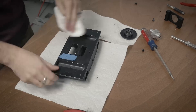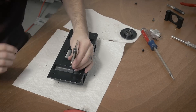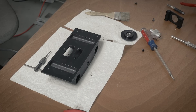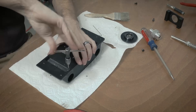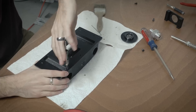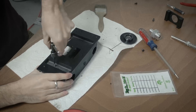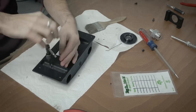The only thing left to do before I install the bearings into the bearing block is to tap these eight holes. One little note about tapping holes: do not do this at 9:30 at night when you're really tired and have been working on this project all day because you will break a tap like I did. I had completely forgotten how fragile a 4-40 tap is — I was going too fast and wasn't paying attention. It really wasn't the end of the world though — for that bearing I'm just going to have the one set screw instead of two.